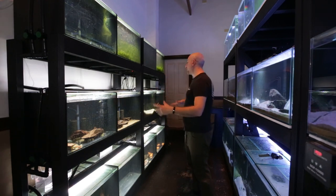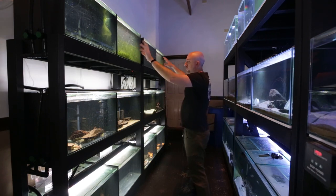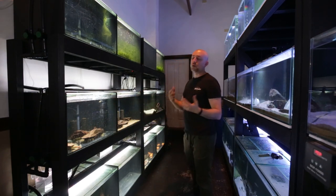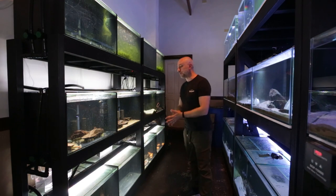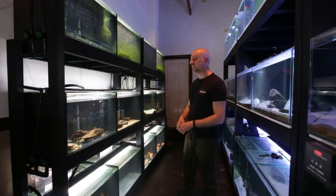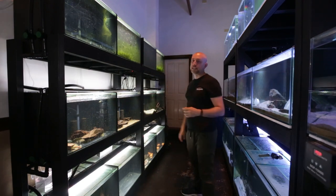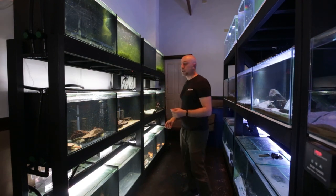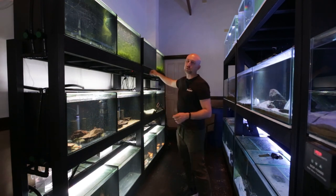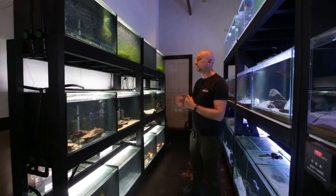The other thing I learned from the test was that when I was draining the tanks with all the inline taps open on all the rows, water started to flow out from the top row first but the bottom row started to fill up with water. In hindsight that was an obvious thing to happen but I just didn't consider it. However, with the inline taps on every single tank I had contingency — I could just close off all the inline taps on the bottom and middle rows and let the top row drain out by itself. Because I only have one hose attached to the whole system, I didn't have to go out and swap hoses between rows.